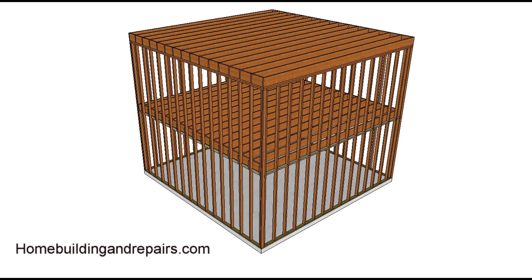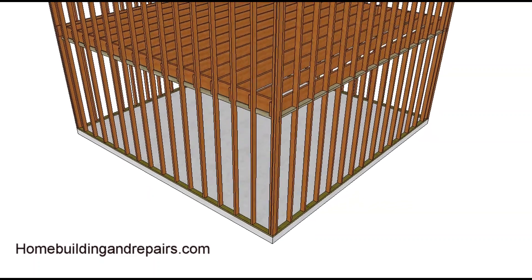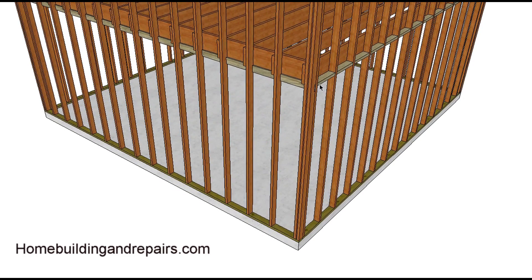In this video I'm going to talk about balloon wall framing, and this is different than just a full height stud. This is basically used to hold up a floor — a supportive floor — with a notched ribbon and nailing the joist into the wall framing stud.